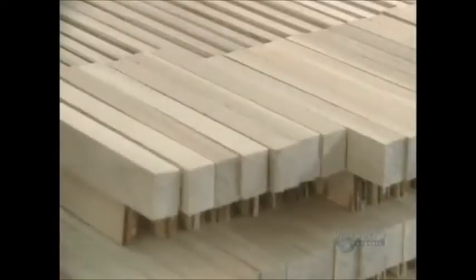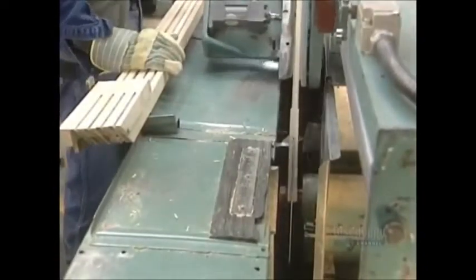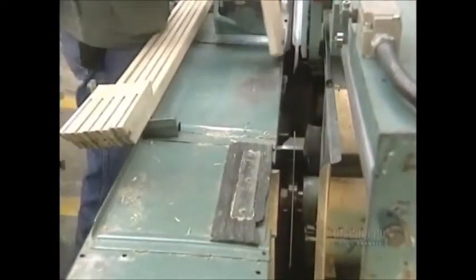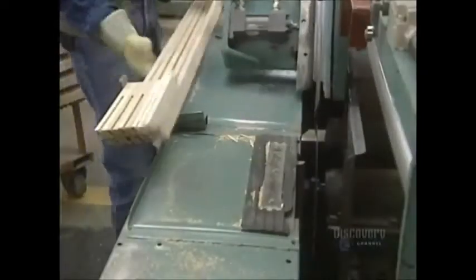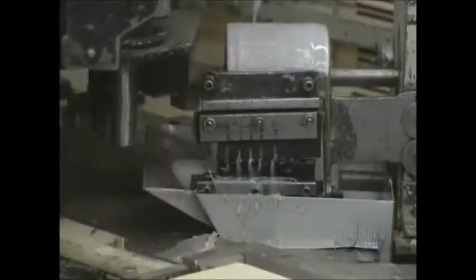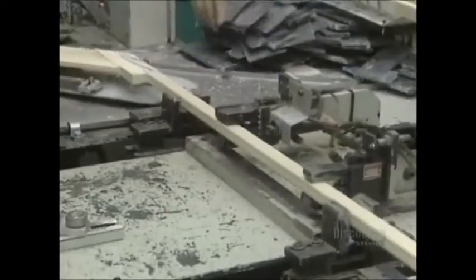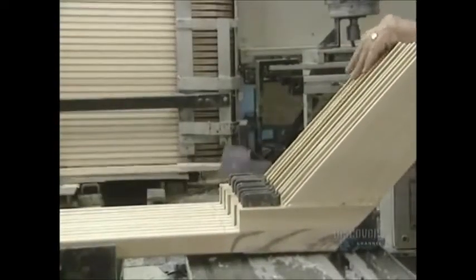The blade will soon be attached to the stick shaft. This slitter cuts the shaft in wood blocks in order to slide in the blade. This machine inserts the glue in the blade into the stick shaft. The stick is placed on a conveyor, leading it to the next step and giving the glue a chance to dry well. Then both sides of the blade are sanded to thin them.